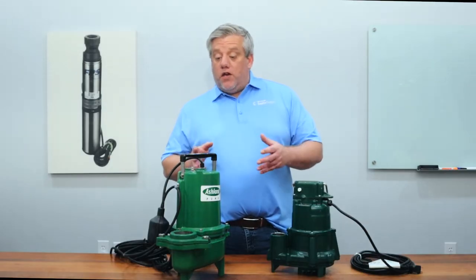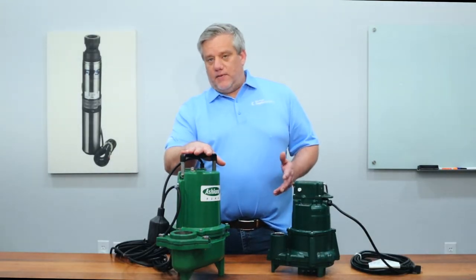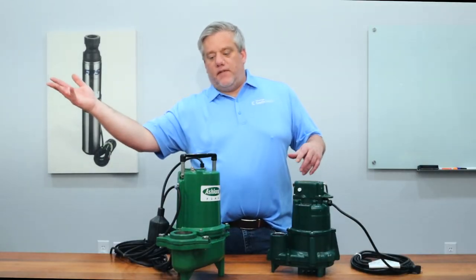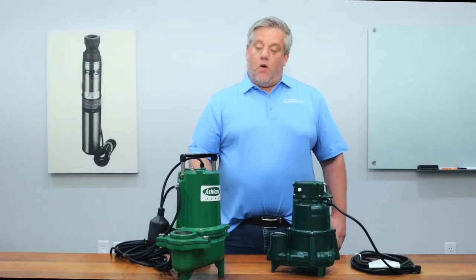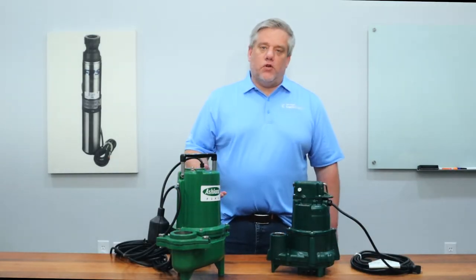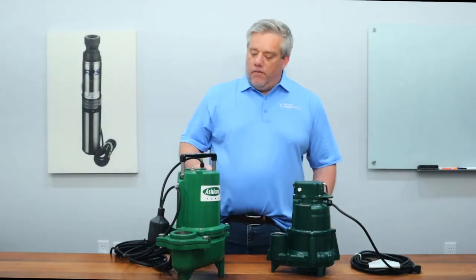A solids pump can cover about 90% of residential applications — you do not need to get a grinder pump and spend a thousand dollars for simple pumping. These are also used to pump to the city sometimes if it's not a pressure main, especially if you have two or three tanks where the first tank catches the trash. You'd have a check valve on it as well. These pumps range in size too, all the way up to 100 horsepower or more for large commercial applications. But for residential use, this covers about 90% of what you need.